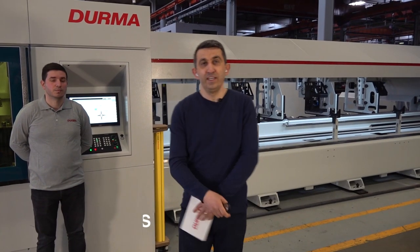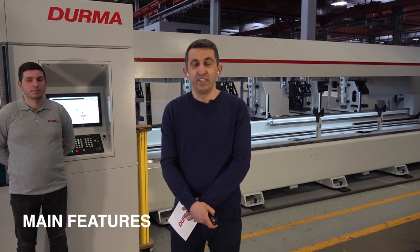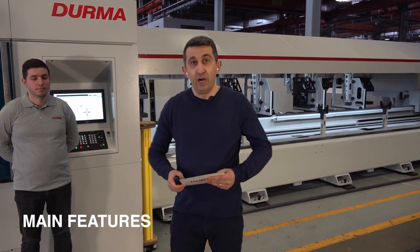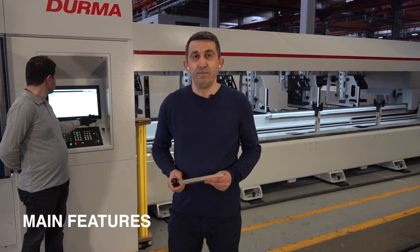Hello, good morning everybody. We are here to show our profile cutting laser today. It is 6 meter and 170 millimeter diameter, 120 by 120 square and 100 by 150 rectangle profile cutting. Actually, our minimum loading size for the automatic side is 20 millimeter.